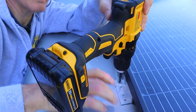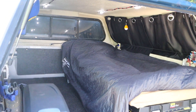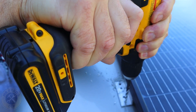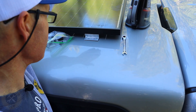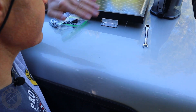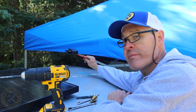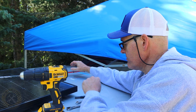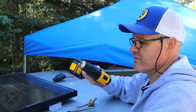The other hole will be closer to the cab. We're drilling these holes — Roger is down in the cab and we've got lights on the ceiling, so we're trying not to drill into the lights down there. We're dry fitting all eight bolts and making sure they all fit before we tighten anything down. I drilled a pilot hole for the node, and then we've got to drill a pretty significant hole to get both wires through there — I'm going to sneak up on it with about a half-inch bit.